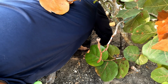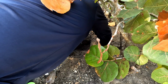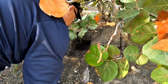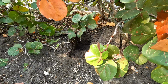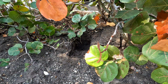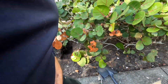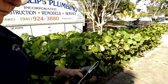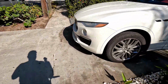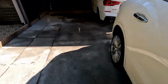Did you see any filters that could be cleaned on that? Well, that's my next thing. I got to take that panel off and look at that. And I took it off and I didn't see anywhere where there's any filters or anything in there. I mean, I'm not a plumber, so I'm not sure if there wasn't one buried in there somewhere. All right, so that's open all the way. It is. It always was, you mean? Yeah. Now you could have an old galvanized water service in here, which is a real problem. It gives you very low water pressure.